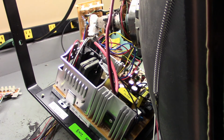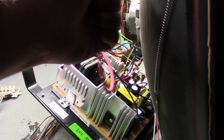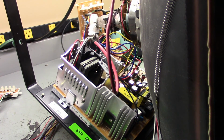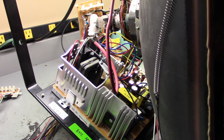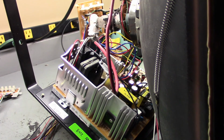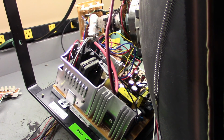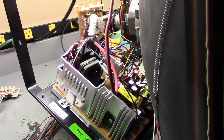Now, that also gives another problem, because let's say you just get one of these chassis by itself with no monitor. Knowing that information of the C909 and D903 helps you out, but if you didn't know that, you wouldn't know whether you had the standard or the medium res version if you didn't have the sticker, if it was peeled off or couldn't find it. And you would have to take a gamble of whether you had the correct yoke or not for your medium or standard res. So fortunately, this is the original tube that came with this chassis, so it all works out for me and the original owner of this.